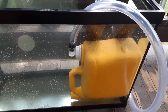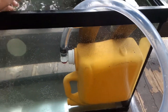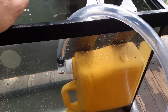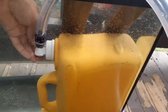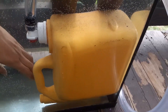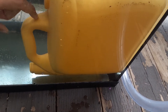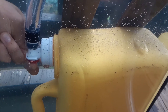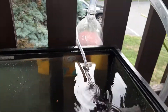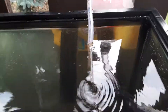The system here is similar to the balloon systems you probably see for water storage, but this one actually has less moving parts. This is less likely to fail if you just move the pump or move the seal to the top. The concept is simple: the tank is full of air, you have an open bottom, and you allow the water itself to directly influence your air pressure inside the tank. The air pressure in the tank will match that of the water pressure in its area. When I release this, it releases air through this tube, which runs to the rear tank — also filled with water — which then, after being pressurized, runs water back into the original tank. This doesn't generate energy; it stores energy for future use.